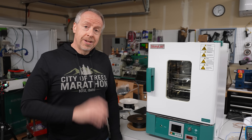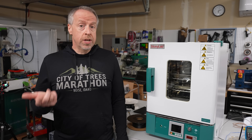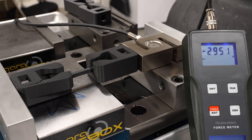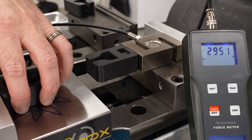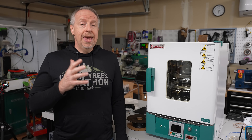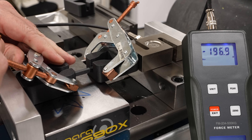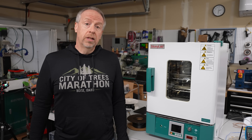Unfortunately, while that idea was a good one, it didn't work. This material is much stronger and more rigid than PAHT carbon fiber, but it's also more brittle, and one of the grips exploded almost immediately. So I switched back to the PAHT carbon fiber grips and did two things: switched to the 4×3 mm specimens to reduce the total force, and put a couple of C-clamps on the grips to keep them from spreading. They probably aren't needed, but they won't affect the measurements and provide a little insurance.